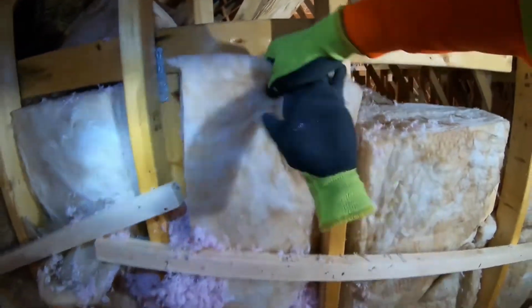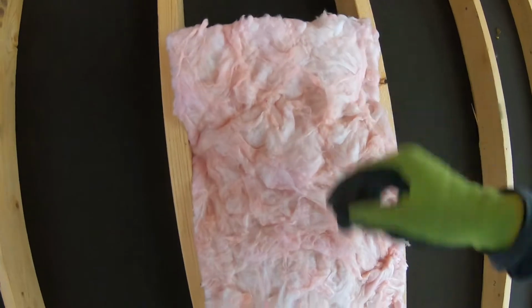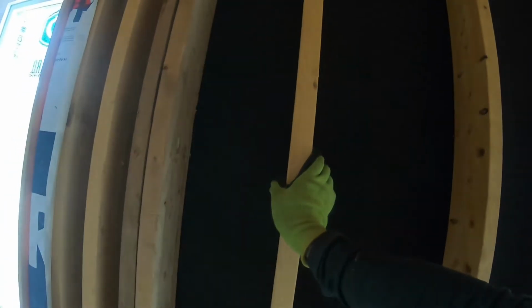Because spray foam, it's a lot more homogeneous, and it resists, right, in any which way that the heat flows. It'll resist it pretty close to the same amount, just because it's all the structure of the foam versus with the sheets of insulation. If anybody's worked with those, you know, if you rip them, it's easy to split them, but it's a lot harder to actually rip them sort of sideways like this by hand, right? Because the fibers are the way that they are, like the way that the sheet of insulation is built. That's pretty much the way that she goes.